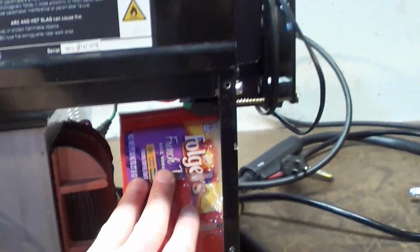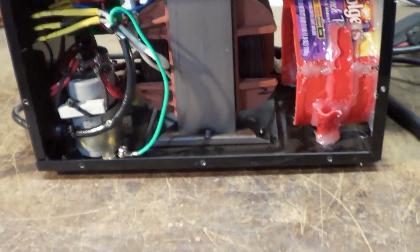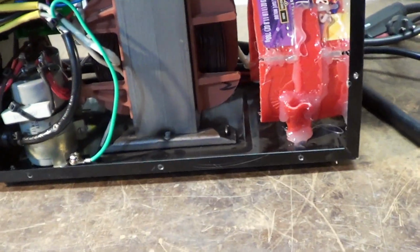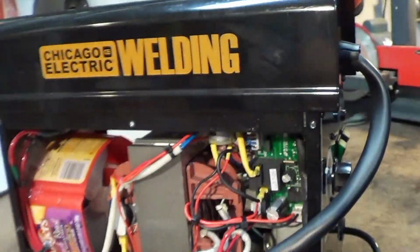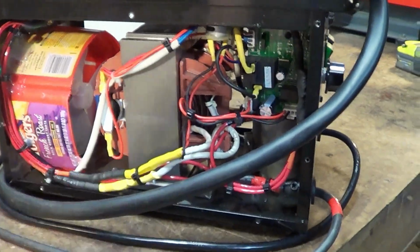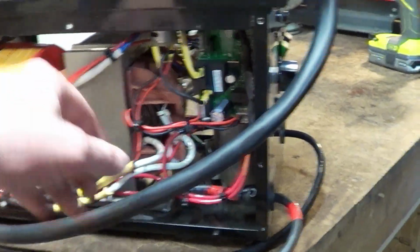I also recommend ducting it in. Before I ducted my fan in, I never felt a breeze out of the louvered vents. And I absolutely do now. The thermistor, the thermal overload, is right here on the other side of the transformer, and so it's literally telling you when that transformer is too hot. So the more air you can move through the case, the better. Without a duct, you're basically tumbling hot air inside the case. That's really easy. There's nothing hard about that.